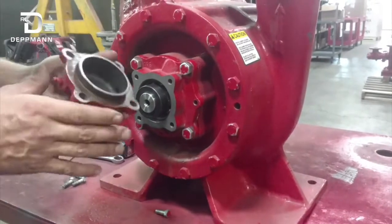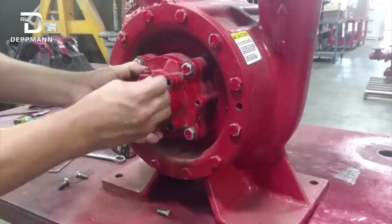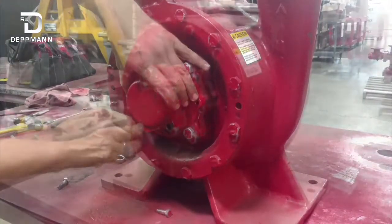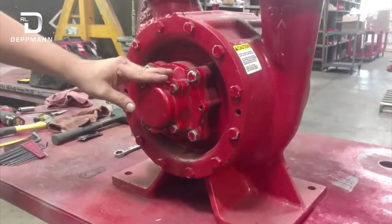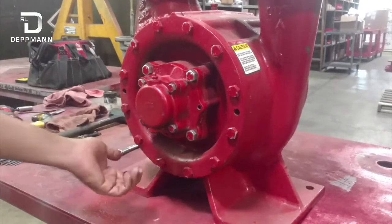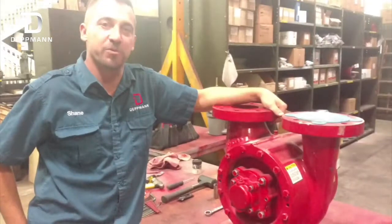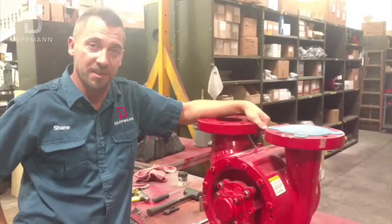Clean all the old grease out before installing the bearing cap, then reassemble. Now that the bearing cap is all tight, you do want to pump it with some fresh grease — pump until you get grease coming out of the excess weep hole down here. Too much grease does not hurt; eventually it's just going to fall down, but that's okay. Hopefully this was helpful on changing a bearing and seal kit on the outboard side of a VSC pump. Thank you for watching.